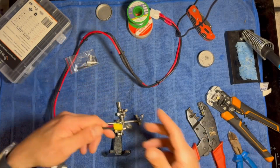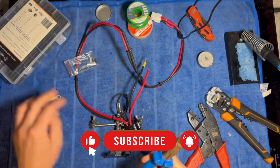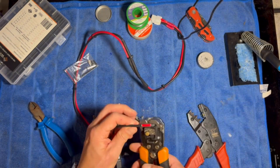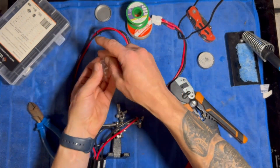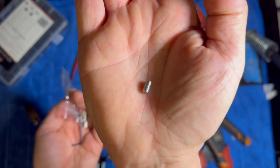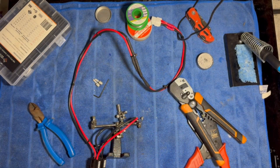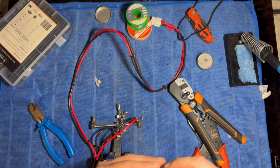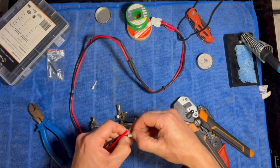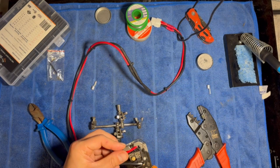Let's get these leads sorted out — first, let's take the old ring terminals off. I need new snips, these are awful. Let's strip these wires and get the posts out. There are two spare grub screws in here; these are for holding the pins into place in the power supply unit itself, so I want to make sure I keep hold of those — and the Allen key too, which I'll add to my ever-growing collection.